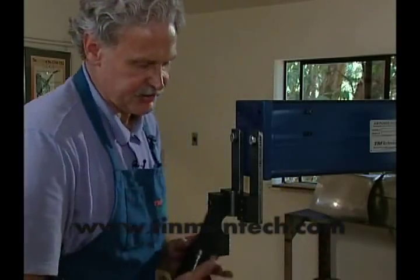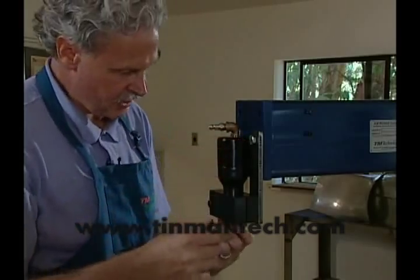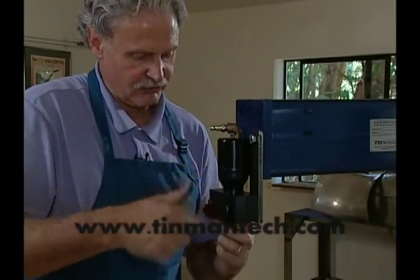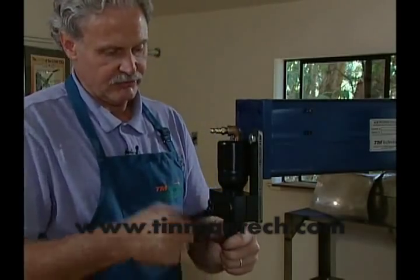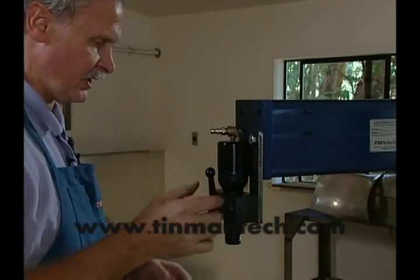It's the principle of the properly tight torque bolt, like the connecting rods in your engine — they work the same way. This is a machinist locking handle. It has special features that allow it to deliver a very high amount of torque with very little pressure, and then it zeros back up out of the way.